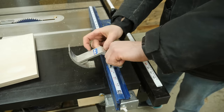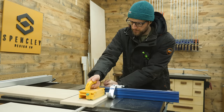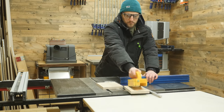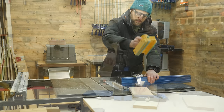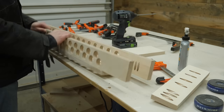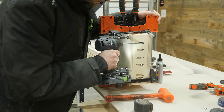With the main arm all set, I can turn my focus to creating the rear box structure. These pieces need to be a little more precise, so I'm using my precision miter gauge with a built-in stop block. Stop blocks are super handy — they help hold your piece during the cut and allow you to repeat a cut when you need the exact same measurement on another piece. All the pieces for the rear box structure are going to receive pocket holes to join everything together and give it a lot of strength. I can then flip the main arm over, attach the back piece, and slide the other three pieces over top before firing in the rest of the screws.